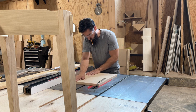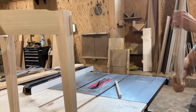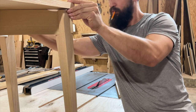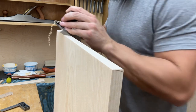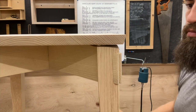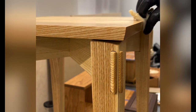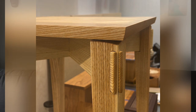Once that's dry, it's just cutting the tabletop to fit. I wanted this tabletop to overhang the exterior of the leg by about a quarter of an inch in any direction, so that when I put an edge profile on the table, it just swoops right in to almost kiss the exterior of the corner. Break out the hand planes, give it a little hand touch, then check the visuals. Frankly, I really like the way this table came out — it's a really pleasant little object.